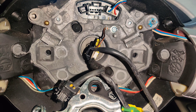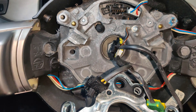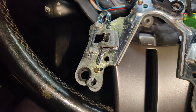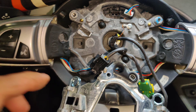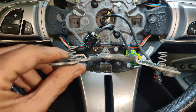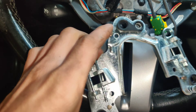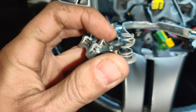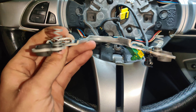I'm going to have to inspect this more and see if it's touching somewhere. Look how sensitive that is. So this has got to be touching somewhere — we'll have to see why that's happening. Well guys, I found our culprit. Look at the marks — you can kind of see them. Hopefully they show up better with the flashlight. See the marks right there where it was contacting. I think this whole bracket's bent. Look at that — now they show up really good. I think this whole bracket's bent — it was contacting in spots it wasn't supposed to contact. It's only supposed to contact on these metal pieces right here. Somebody probably pushed on the horn too hard.